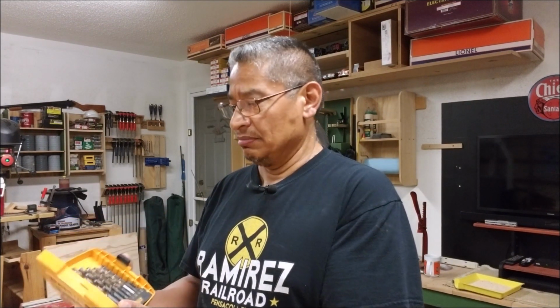Drill bits. Don't go cheap on the drill bits. And you can see most everything I built in my shop, I have built with this little set of drill bits. We're not talking a bunch, okay? Just a small set, that's all you need. But get a quality set. The idea of it is pine is a very soft wood. It splinters very easily. It's easy to rip out the back where it's a big blowout hole in the back. Good set of sharp bits is what you want. Take care of them. Don't drop them.